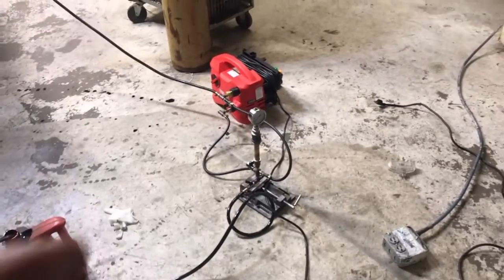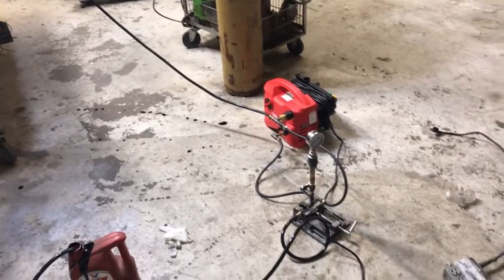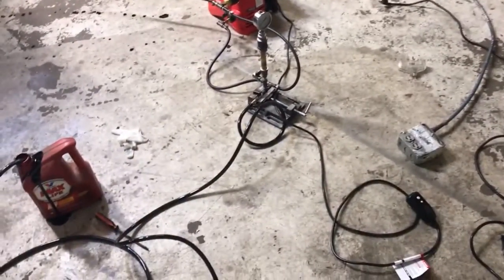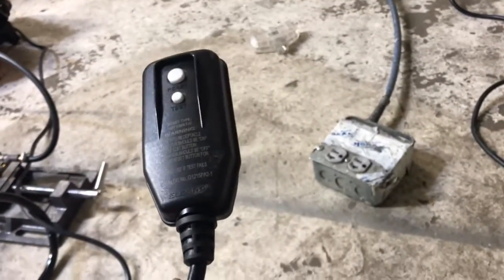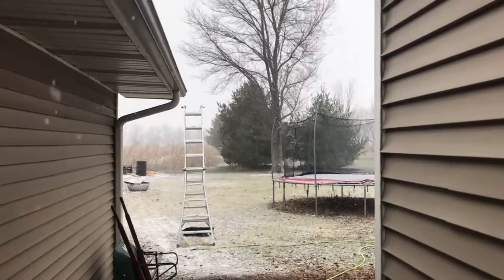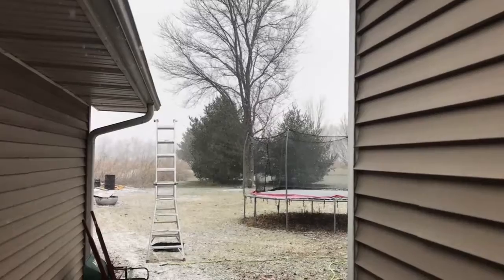As usual, I like to do a quick preliminary test off camera, because something always goes wrong when you first turn on the switch to anything. First thing I noticed was my tank was full of water, so we got all the water out of the system. Then I noticed the router speed controller wouldn't work. I'm chalking it all up to this bad boy right here. So Aaron, we're going to have to chop this off, fellas. I'm going to send you with a cord end — it is affecting the chopping effect of the triac circuit. It's not really a pulse width modulator, but it's similar to that. I'm racing the clock here; we've got a blizzard on the way and I've got a million things to do.